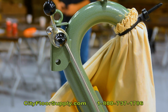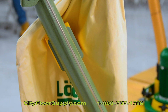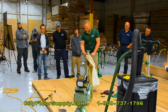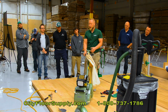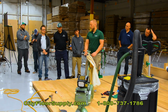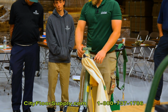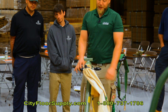One component that wears out over time is the entire lever. A lot of people tend to push down because they think it increases pressure. The problem is it's gonna bend the entire piece. If you think about it, you do that 1,000 times a day, it will wear out over time. So if you can see that it's bent or it doesn't go as smooth as it should, that piece needs to be replaced once in a while as well. But that's pretty much it.